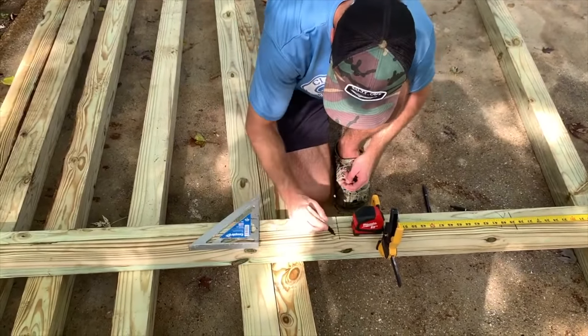So at this point, you have all the knowledge you need to continue to install row after row of shingles. Be sure to maintain a 1/4 inch overhang over the rake drip edges and continue to leave an overhang on the opposite rake side of the shed. At this point, I'll let the time lapse roll for your benefit. Feel free to skip ahead, but essentially we're following the exact same process.